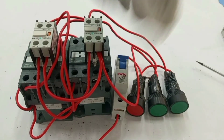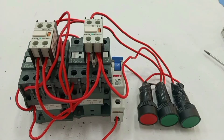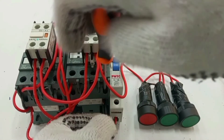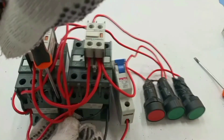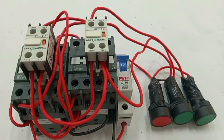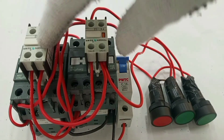This circuit is powered by 230 volts, so make sure all live terminals are properly insulated before testing. It's left with the neutral connections to A1 here and then A1 on the second contactor. This main neutral — I will take a loop to the other coil. And so that brings us to the end of our wiring. It looks a bit complex at the end, but if you carefully follow from the beginning, you would realize it is quite simple to do. These two start buttons will help to energize each of the coils one at a time.